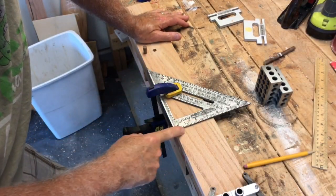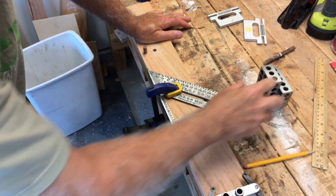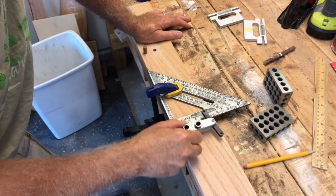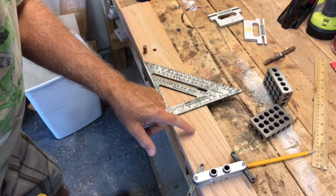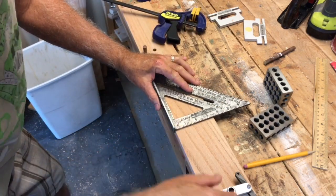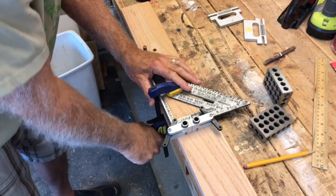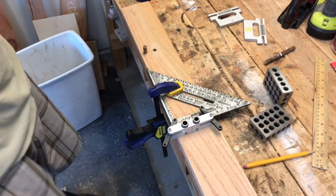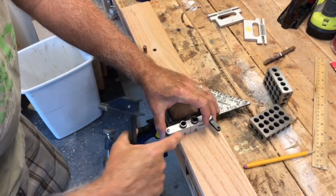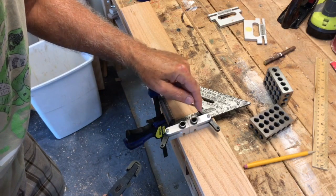The best way I've found for centering these holes is to have my line determined exactly where it's going to go, with the one-inch end mark as measured with my 1-2-3 block. After I have my jig eye-centered, I drew a couple of lines to verify it was in fact centered on the width. Then I take my square, match it up, and clamp it so it doesn't move. Once I have that tight, I can attach this with a clamp. I use my F-clamp after I have this line centered off that one-inch mark, and I'll clamp this right on top to drill one hole, then change the clamp and drill the other.